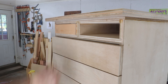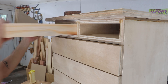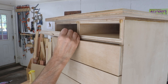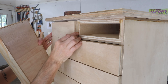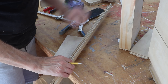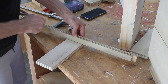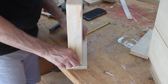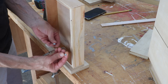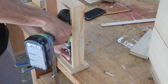These top drawers are going to be a little different — I want the face to come up higher rather than flush with the top, just to give a better, more finished look. The drawer faces also won't be centered on the drawer; they're going to be offset a little so there's a gap between them. I draw a line on the bottom and on the left side to position them. I'd prefer actual pan-head screws, but all I have are pocket hole screws — since this is just a shop project, it doesn't really matter.